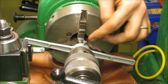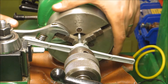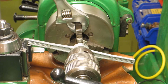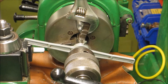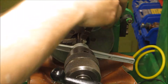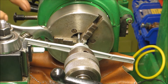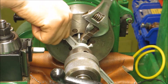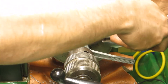The dimension was wrong — I needed to go to 265, not 290. That's okay because I turned it down. Now I'm threading on the lathe. I'm not single-point threading because my gearbox is still out of commission and I don't know how to do that yet. I am using a tap and I'm literally just grabbing on the vise jaws. It looks like it's making a thread — I hope it's making a thread.